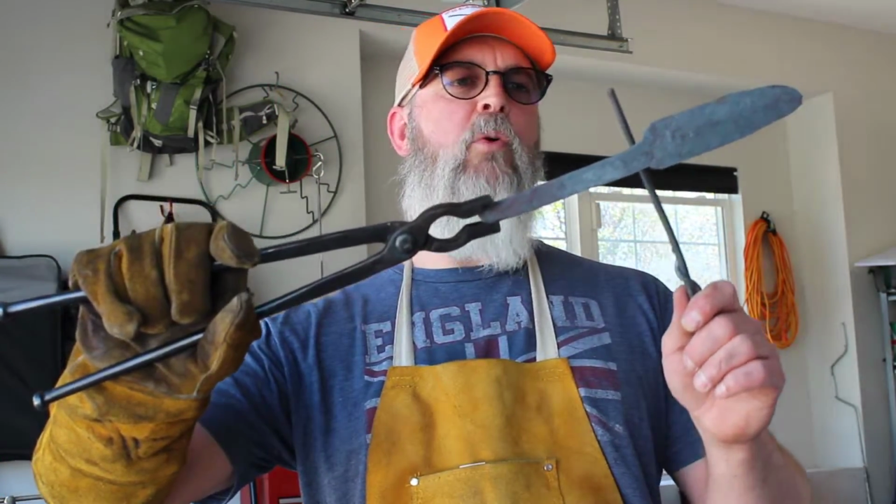We'll just shape this out on the grinder, start getting a little bit of a bevel on there. Obviously that's not anywhere near sharp enough for a knife. But again, I don't want to go too far, because if I go too far, then when I quench it, it might warp. And then for the hidden tang, it's super long right now, but that's okay. It actually helped me work it on the anvil a little bit better. So we'll just tidy all this up, get it in a rough grind set up, and then from there we will move on to do the quench.